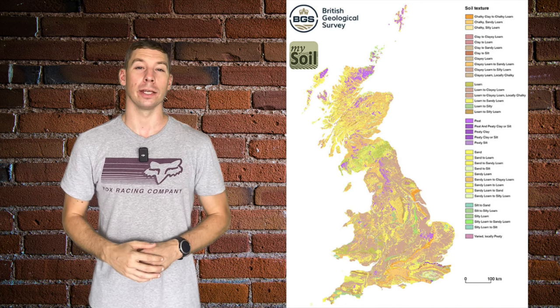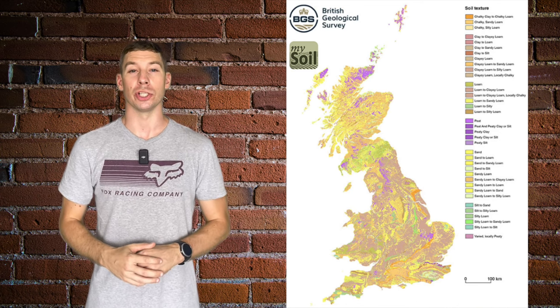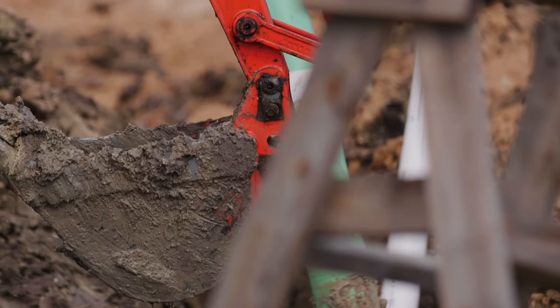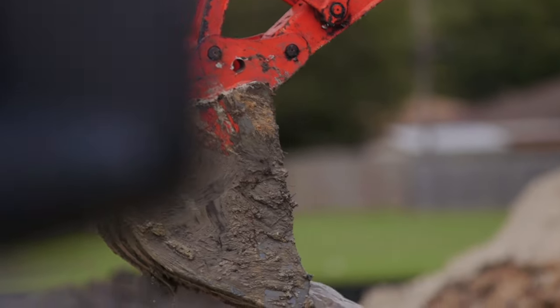If you're in the UK, you can easily find out what soil to expect by checking out the British Geological Map, which I've linked in the description below. Clay soil changes in volume due to water content. If you're digging into clay, you'll need to dig to a minimum of 1 meter deep from ground level or until you reach good ground.